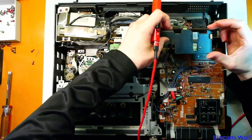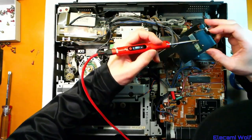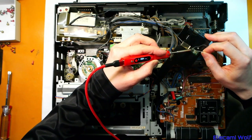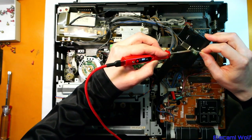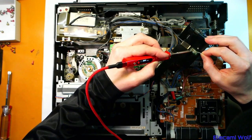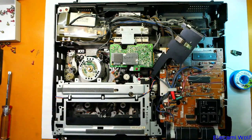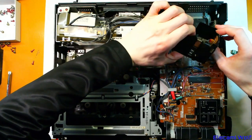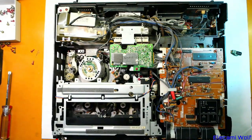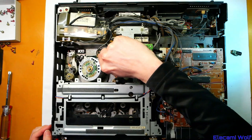Since the operation display on the front is still showing as though it's not running or initialized — is it possible that due to the bad connection on that transistor, there was some sort of spike on the power supply which damaged the microcontrollers? The clock one and the operation display — those are re-soldered now, whether they needed it or not. We'll turn this on again. Power's up okay — but no, it's still intermittent. I think that connector there is bad.